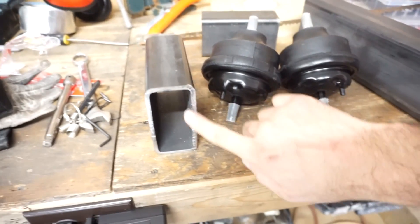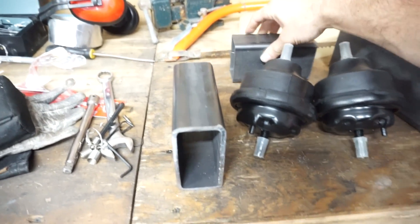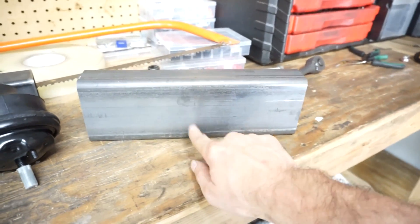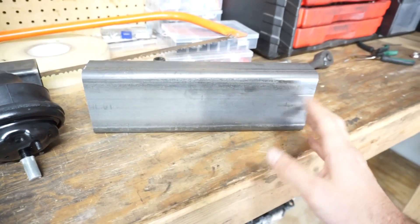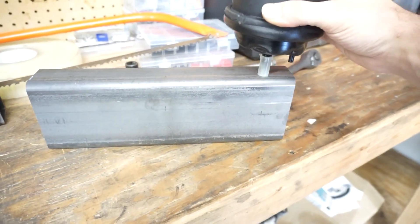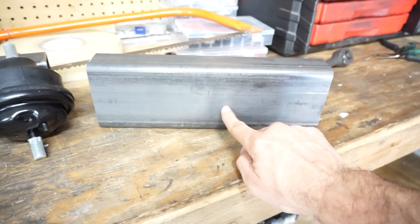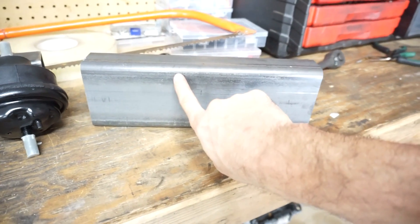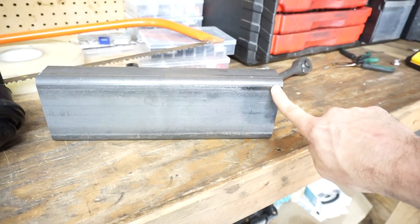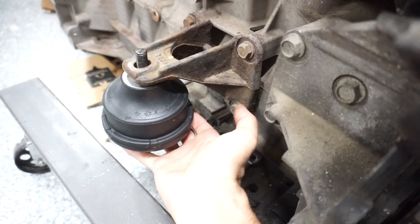This section here is five inch, three-sixteenths thick. I did have this little guy here but I wanted to go a little bit thicker just for something to weld to. For this piece I'm probably only going to use about half of it, but I bought it long enough so I can cut what I need. The plan is to have this mounted up on the end like this, cut down at an angle. So I'll have this piece welded onto the car, and then this will come up at an angle — a little bracket to mount the top of the motor mount to.